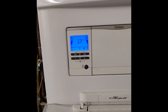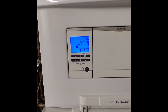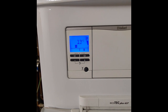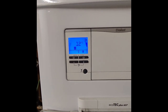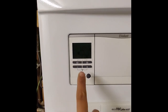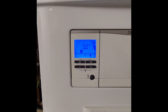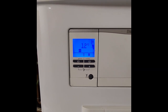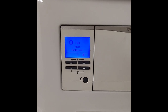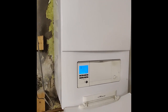We've reset the boiler and it's going through its motion trying to light up - and it's gone off. Trying to light up again, and it's gone off. Trying again. I think it's going to try one more time and then go to lockout. Yep, couldn't light up - F28 and F54. It could be a combination of things: spark electrode, gas valve, or the PCB itself.